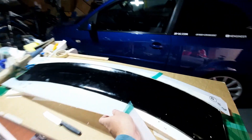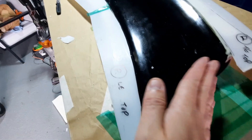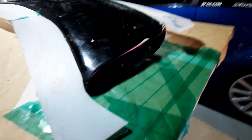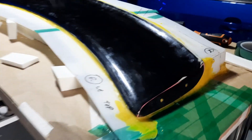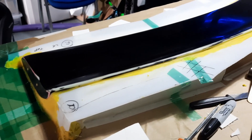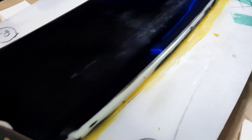Here's the leading edge parts going on and the sides. Clearly I'm going to have to do some work to fill gaps, and this is where the skill and the time and the effort really comes in. I've been using a mixture of plasticine and a yellow wax to fill all the gaps, and then running around that with a tool to clean it all up.